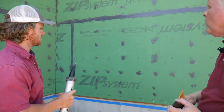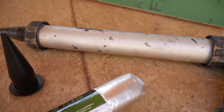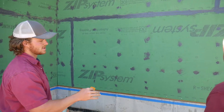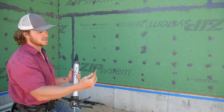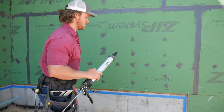What tricks have you found to put this stuff on with? Really just making sure you get a nice little bead, because then you can press it and if it's indented a little bit you get to push the sealant into it so it gets a nice good seal instead of just being surface. And once it dries, if it's not heavy enough of an application, it can crack.